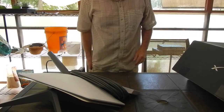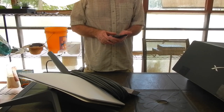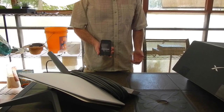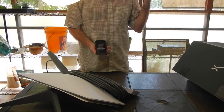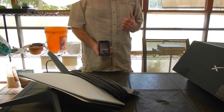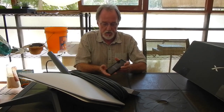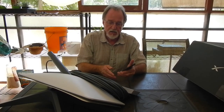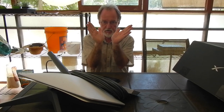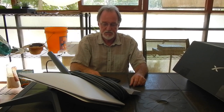So that is pretty much it for this kit. The Starlink app is kind of cool — you can order it and start your setup. The way the camera is facing is south, and I did show some obstructions. There's a good online map — I'll put a link to that in the description — that shows where the satellites are. From our location it's pretty much going north, with a spread of about 90 degrees centered on north. So I'm going to have to put this on the other side of the house — completely opposite to a TV setup.